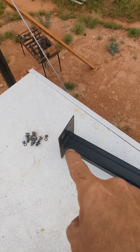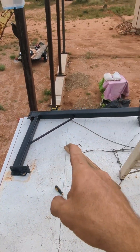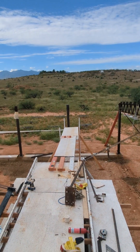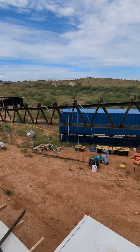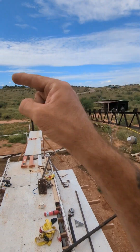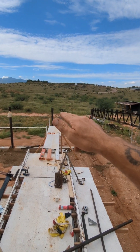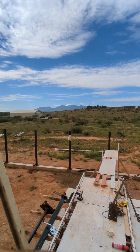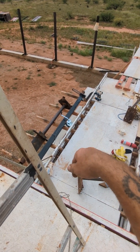This thing will bolt onto here, and I do the same thing — another sleeve down on that other post. I have two hoists. What I do with the truss is I do it in 20-foot sections because steel is sold in 20-foot sections. I run a string line from here to here — so it's a 40-foot string — I tighten it and make sure it's as straight as possible. When I lift my steel up with the hoist, in the center of the truck I have another manual winch.